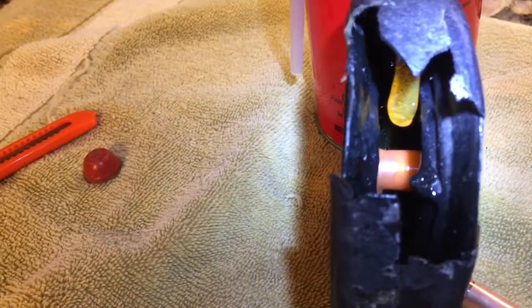A lot of this was determined because inside the hub, to the left side, there was actually a little projected area that I needed a plastic tubing to fit over. I needed the outside diameter of that tubing to fit pretty tight, and then the inside diameter of that tube to be the size of the axle.